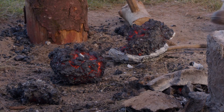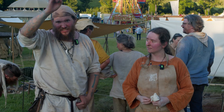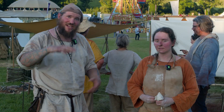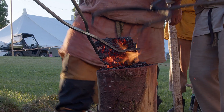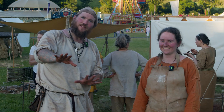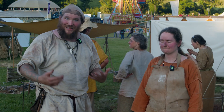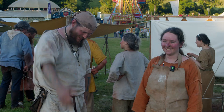Then it was taken over to a log for hammering — worked it down a little with wooden mallets. A fair few pieces were breaking off and there was an overhang I thought might snap, but actually it was crushing down and squashing quite nicely, holding a good shape. That's definitely a good chunk of iron. With three pieces, I think we've definitely got enough to make a sword — if not maybe two. A great success, especially considering at the end we were really worried it was getting clogged with slag and we might not have gotten enough iron ore in there to create a workable bloom. Now potentially we might have three blooms to work — on to tomorrow.